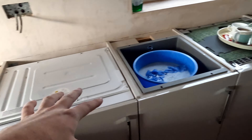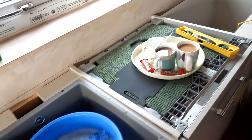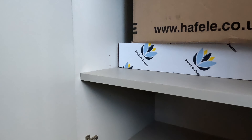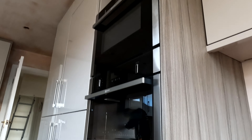I think we've got a socket to go in down here for these two appliances, and there's a hot tap going in — I need to check the plans. In the back of one of these cupboards we've got the extractor as well. In the back of there, we'll put a 20-amp switch to do one of the ovens, because we've brought in a feed just for that. Then we'll have to put a double socket as well, which will pick up the other oven.